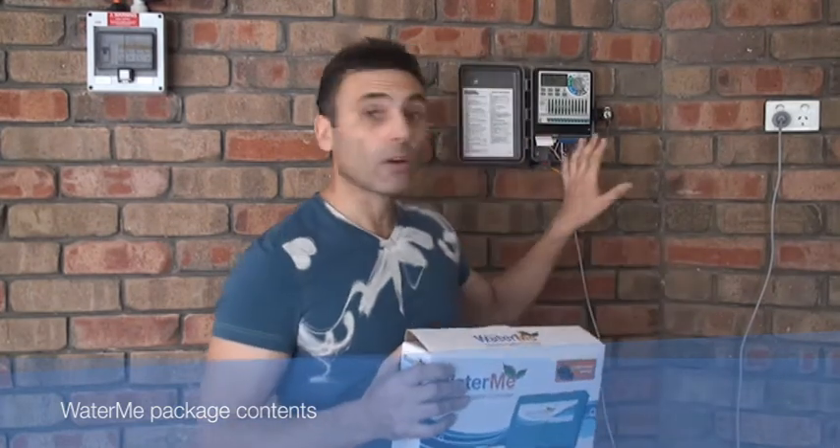The system will not only let you know about leaks but also let you know if the flow has changed from the last time you watered. NYMAT has been a quality Australian manufacturer of valve products for 15 years and we understand completely your requirements. We've come up with a reliable, easy to use, easy to install product that delivers the next generation of control to your fingertips. Let's begin by opening the WaterMe box and letting you know exactly what you get, and then we can start talking about how to remove your old controller from the wall if you have one and how to install the new one. So I'm just opening the box. Inside the box you'll see the controller itself. If you open those two compartments you'll see a power supply and you'll see the flow sensor.